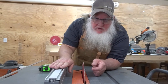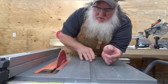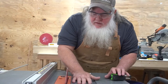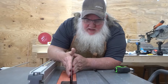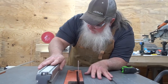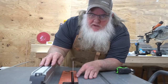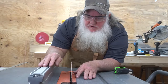While we were looking at that, we realized also that this blade is not parallel to this groove — the blade is actually twisted a little in relation to the table. So we're going to do a full tune-up on this, starting with heeling the blade to the table and then heeling the fence to the blade. That's a fancy term they call it for paralleling. We'll show you the steps on how to do that.